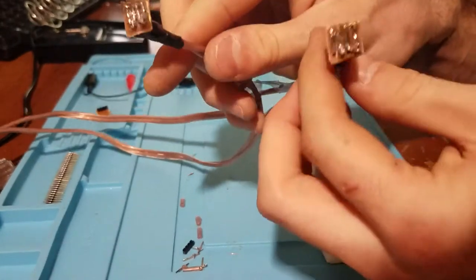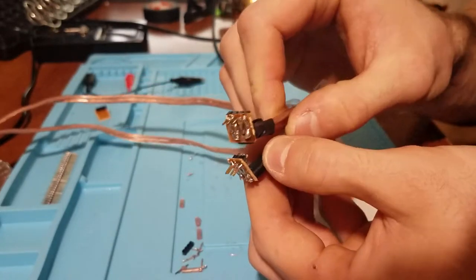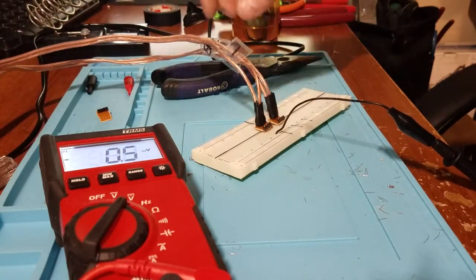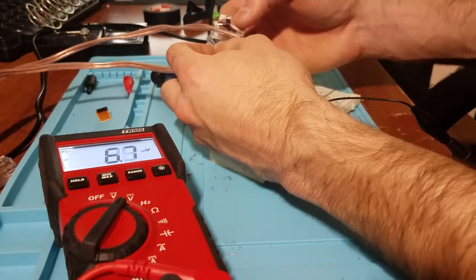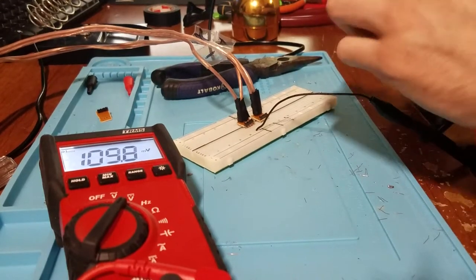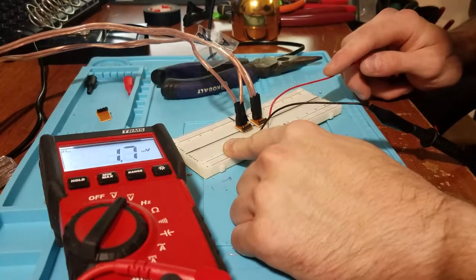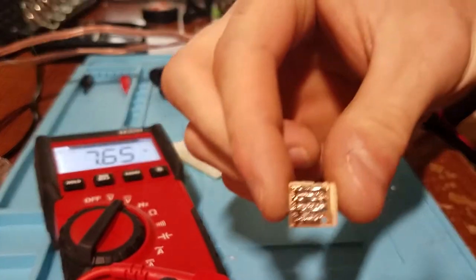Now I should be able to plug these into my breadboard. I'm going to check across the circuit board and make sure all of these pins are connected properly. As you can see, I have these wires connected up to these bridges and I'll be able to plug them in directly into my breadboard. I have my battery cells off camera, connected up here and labeled negative, series B, series A, and positive — those are the different series I have in there. I need to test some battery charging circuits. I should be able to jump across these and see the first cell at 3.8 volts, the second cell at 7.7, and all the way up is 11.5 — and that is the final product.